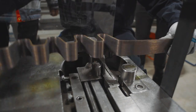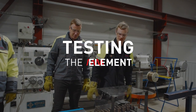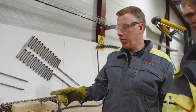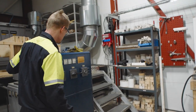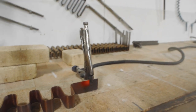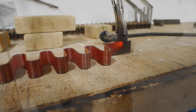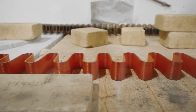We have formed it. We think we have got no cracks, but we are going to check if there is a crack in there. Okay, so we have formed the element now. We are hoping this is a good element. We are now going to heat it up again. Emil, can you hit the current please? There we go. We know we are going to get current through this, so we know we are going to get it hot. You can see it is starting to get red — getting there pretty quickly. It looks very uniform. There are no white spots. This is a nice, good element.